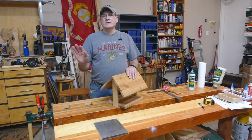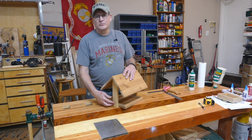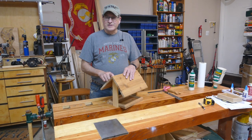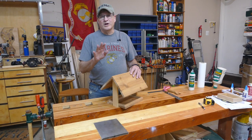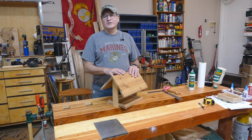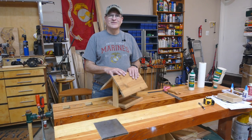You don't need to use an air nailer. If you're doing this with kids, just pre-drill for one inch or one and a quarter inch brads on the top and three quarter inch brads on the side. The only reason you're putting the brads in is to hold it together while the glue dries. Be generous with the glue — the cedar sucks the glue up pretty good. If it squeezes out a little, wipe it off, don't worry about it. This is an outside project — the birds don't care. That's why it's great for kids. Also down there is a bunch of links to tools and things that I use — go ahead and explore those. If you got something out of this, hit like and subscribe — I'd really appreciate that. Until next time, good making.